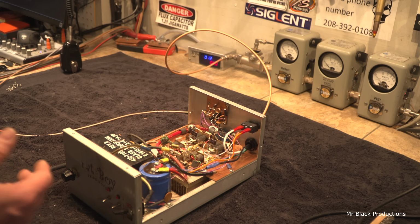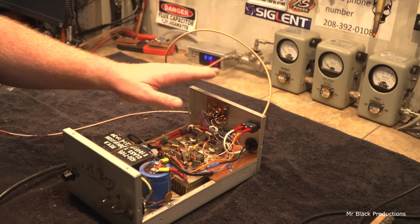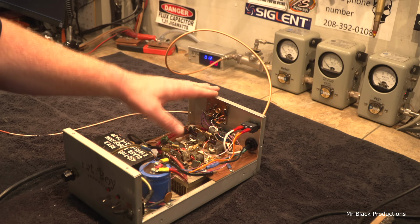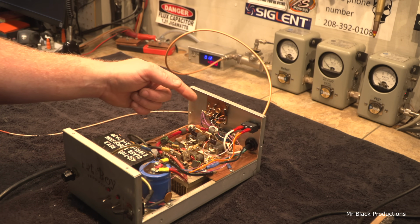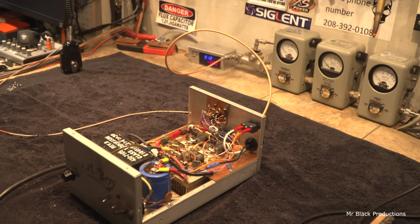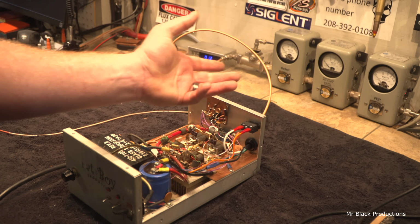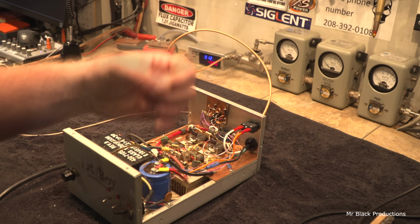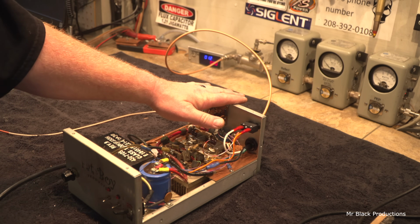There's a give and there's a take. This particular amplifier, 9 times out of 10, how we match that impedance bump, that shift in resistance, is that we add a little bit of capacitance, either on the input or the output side of the relay. This particular box wanted a little bit longer wire. I think I already pitched the wire. The wire length that was in there was about yay long, which is generally what you want. You generally want the shortest wire lengths that you can, anything that's mucking with the relay connections.